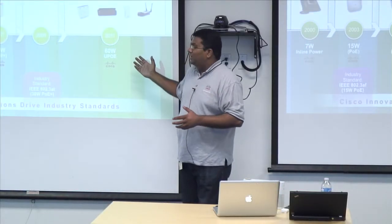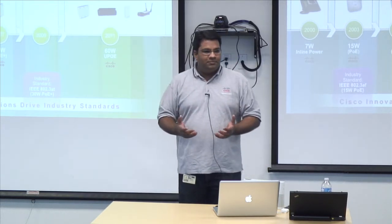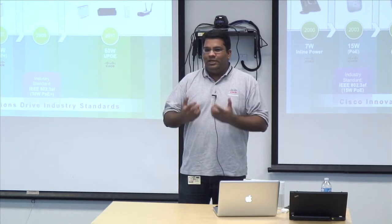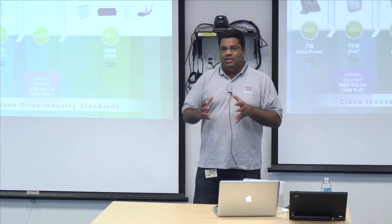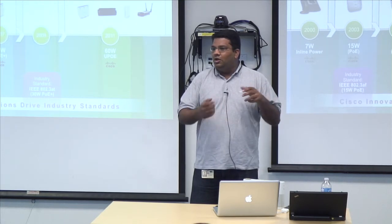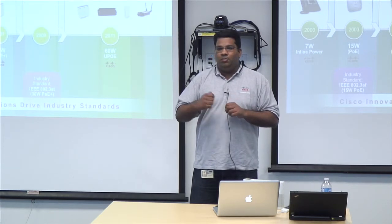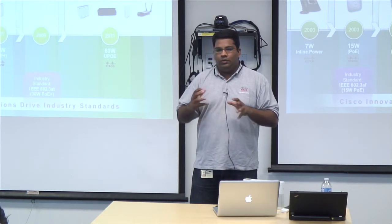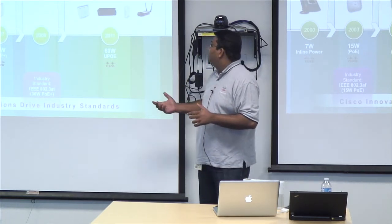And now in 2011, we did 60 watts. And some of you might be asking, what were you thinking? Why did you do this, right? Now, we realized that while 30 watts was good enough, if you wanted to extend the resiliency of what we have on the switch, data resiliency, power resiliency, onto a single wire for customers to enable end-to-end solutions, we needed to put more power on the wire, okay? We did some investigations, we figured out how it works, which I'll share with you in a minute, and we launched 60 watts, and we called it UPOE.